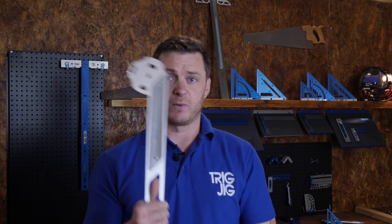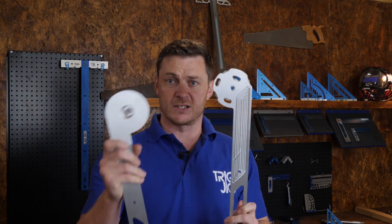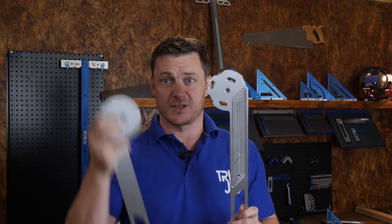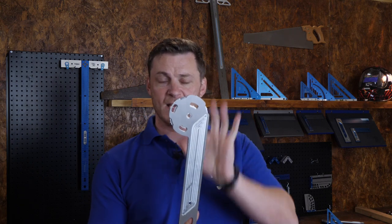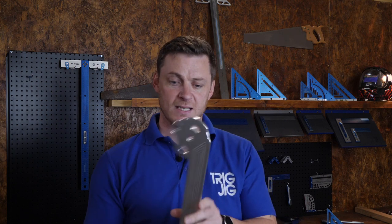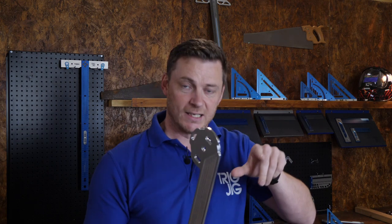This is what we're making — when we're machining it, this is what we're making. There are two arms: basically a lower and an upper. The lower is the one that we anodise blue and then laser all of the scales onto it. The upper is the one that has the windows and the arrows — these arrows are hand painted just so they stand out and are a little bit easier to see. The great thing about this is it hides all of the other numbers on the dial, the things that confuse your eye, and it only points to the ones you're actually wanting to see.